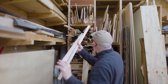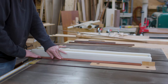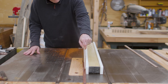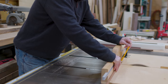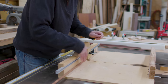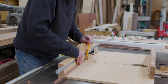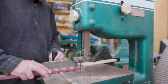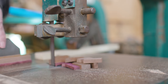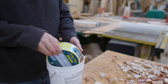What I really needed was a series of scrap pieces that were the right height. So I ended up finding a different kind of scrap wood in the shop — sticks left over from projects — and I could cut those to widths that would work for the land in the map. I started cutting strips to the length of the map height on the table saw, but that seemed like it was going to take forever. I then set up a stop on the bandsaw and could cut a series of strips all at once, which was much quicker. This gave me a bucket full of scrap pieces that would all be the right length.